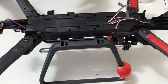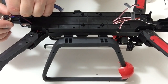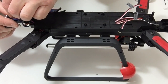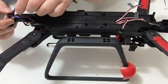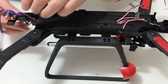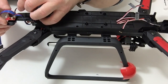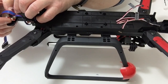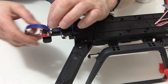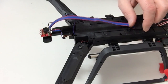Next, taking the LED cable from stage 37, connect that up, carefully pushing it down into position and making sure it's secure. The other cable goes into the vacant slot at the front — the small one goes in here and the ribbon cable goes in at the front — and that completes this stage.